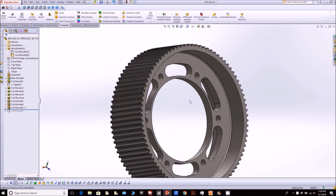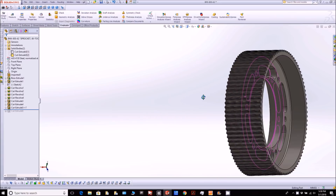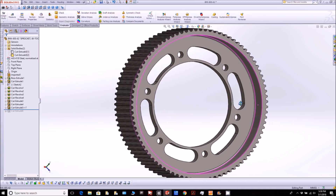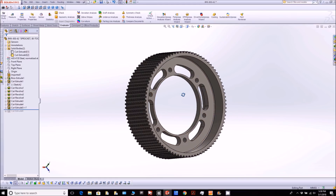The new 89-tooth pulley will give us a better ratio and we should be able to get the engine up to 3,800 RPM, because right now I can only get up to about 3,500. That'll give us the extra horsepower — we should be able to get about 400 horsepower if we can reach 3,800 RPM. You'll see more on that coming soon.